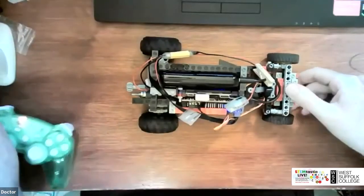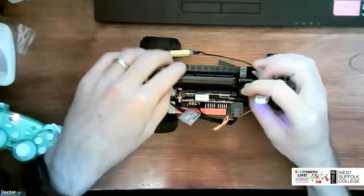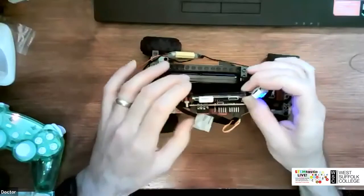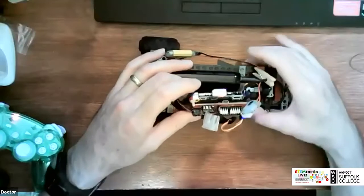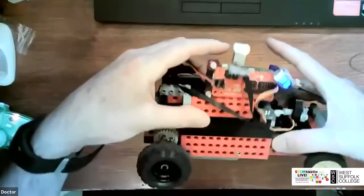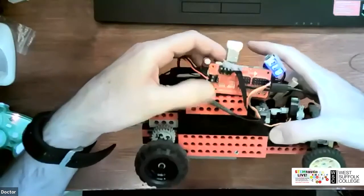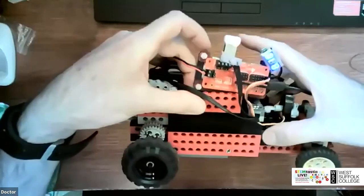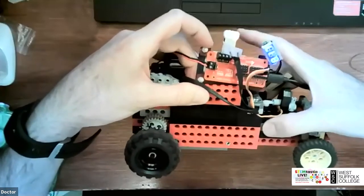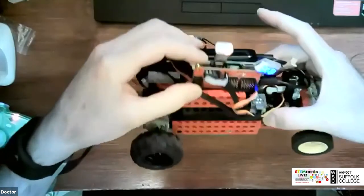The rest of the robot, and we'll come to the controller in a second, is very much the same principles. We've got a battery providing us with some power. We've got a Raspberry Pi. In this case, it's one of the Raspberry Pi Zeros, the really miniature ones. And on top of it, we've got a controller board. This particular board is called the Picon Zero, and it enables me to drive motors through an H bridge, exactly the same as before, as we've seen on all the other boards. But it also has servo driving outputs so that I can make the steering servo work.